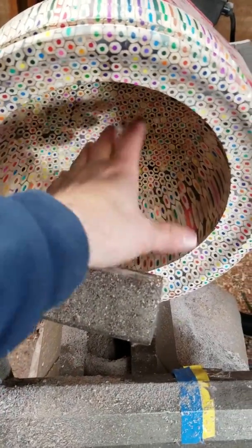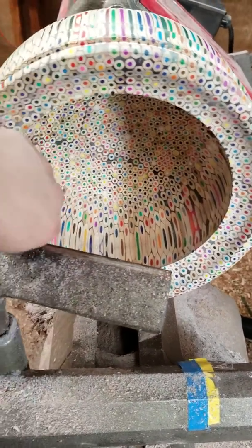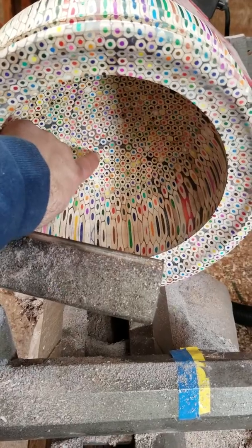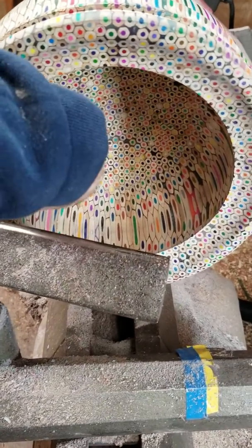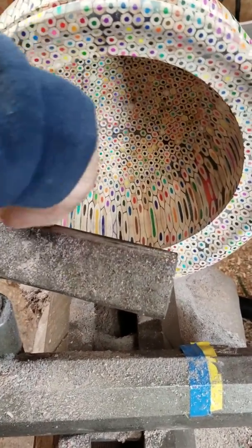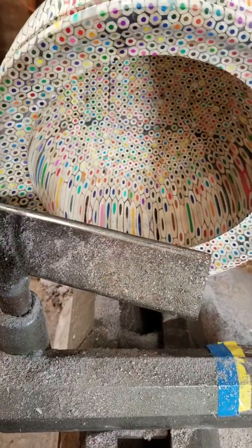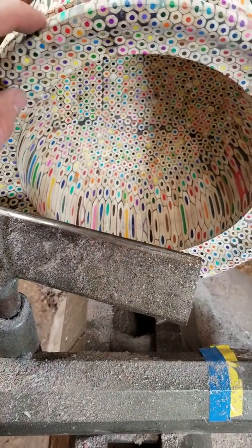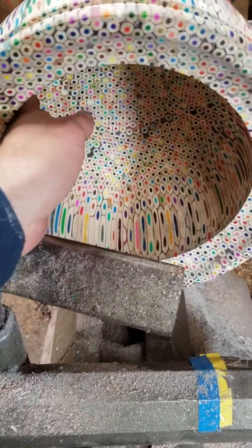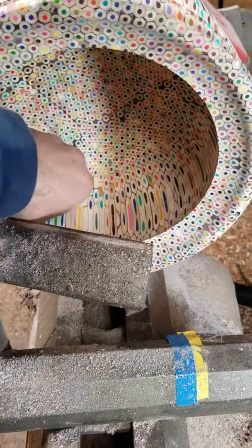What I did was essentially just burrow down, make a cylinder first, and then start shaping the outside and the bottom. The issue I ran into was that traditionally in a lot of bowls, the meetup between the side and the bottom is often the most difficult — you have to make that smooth transition, and it's not easy to get that nice continuous curve.